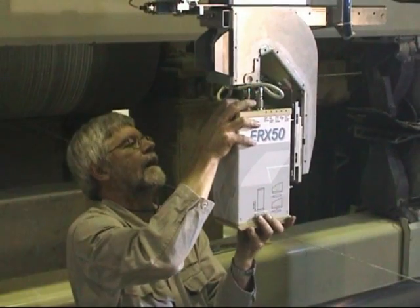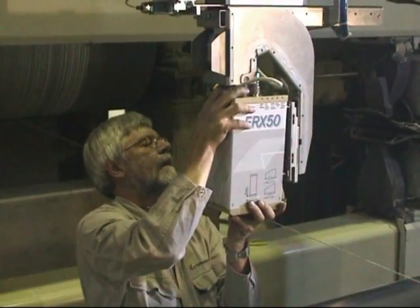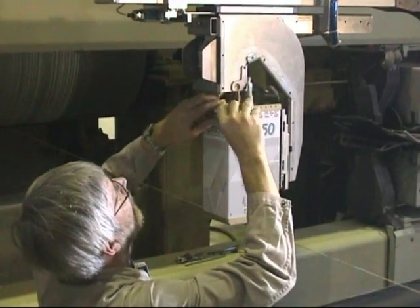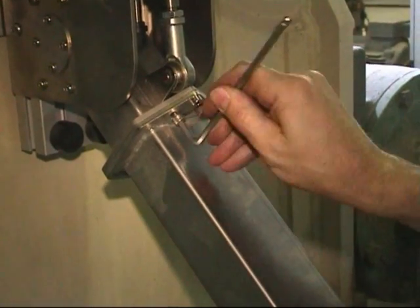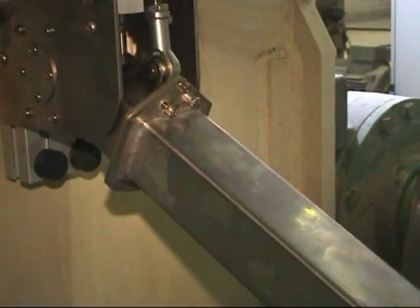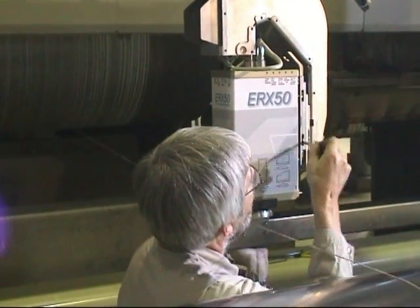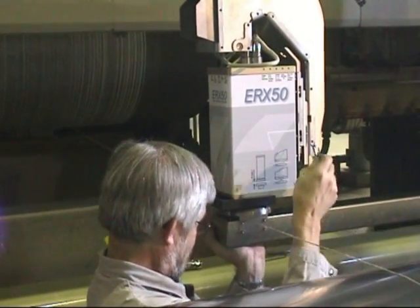The spectrophotometer will be fixed to the frame by a snap closure and locked. The background plate and the measurement instrument will be adjusted vertically to the paperweb. The spectrophotometer has to be mounted vertically to the paperweb with a distance of 10 mm.